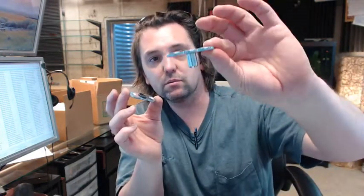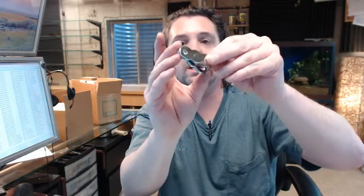Step 2. Step 2 is a real easy one. It talks about installing the top pivot. The top pivot consists of 2 parts, the header portion and the door portion. The machining starts out identical for both. Looking at step 2, you've got a 1.5 dimension from the edge of the door to the center line of that center hole.